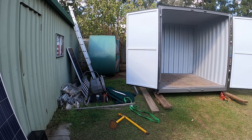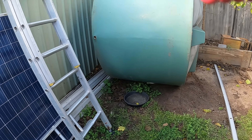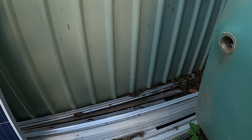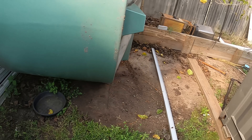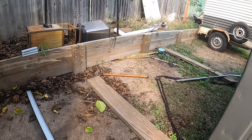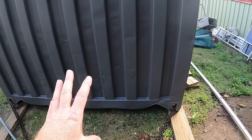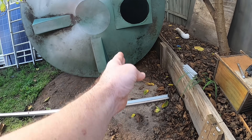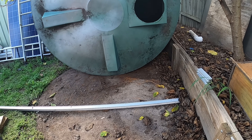I'm a little disappointed I didn't think to clean up and clear the area before I started filming. The electrician is coming in a few days, so I need to move this tank out of the way, clear the solar rail and old solar panels scattered around, and move the shipping container back into its final position. I still don't know the full details of how the electrician will get power in there, but I think I'll need to dig a trench — Australian law requires 600 millimeters deep — and I'll probably do that myself to save some money.